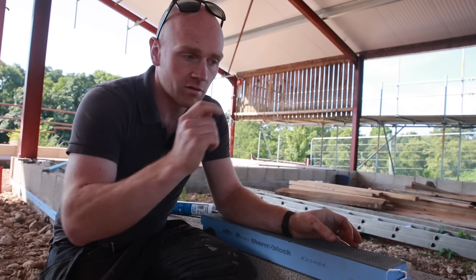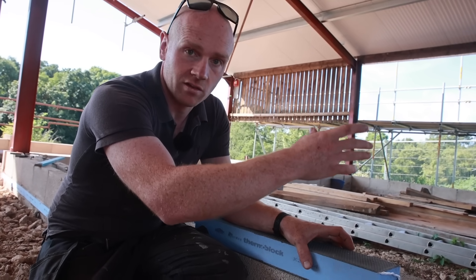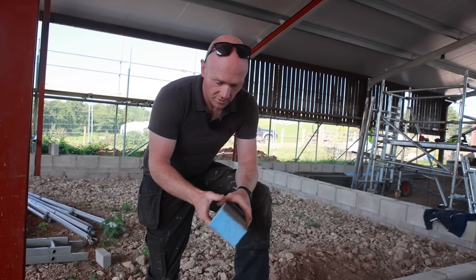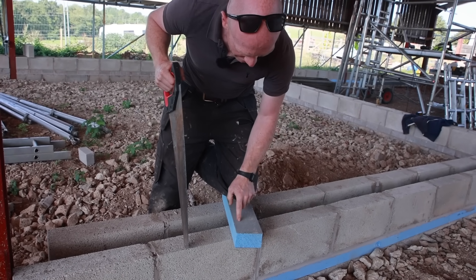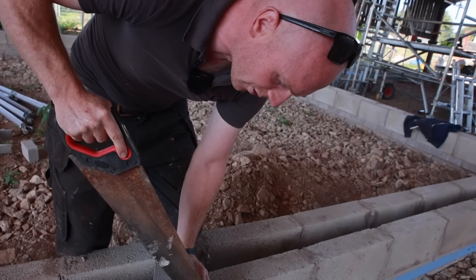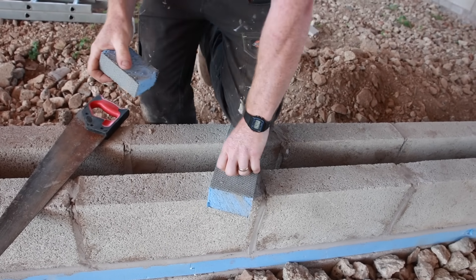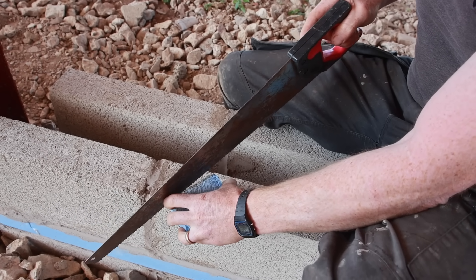You don't want more than one layer but in one instance where we've got a lintel for some drains we've had to overlap by about 100mm — nothing too structural is going on on top of that, but it means we could continue the insulation layer up a little bit higher. As for cutting, it's pretty simple — certainly easier than cutting blocks. The only thing is it's a little hit and miss because you can't really see where the columns are. Sometimes if they get a little damp you can just make out the silhouette of them, but you can get pretty close. Let's do a dissection.